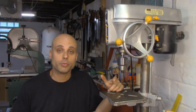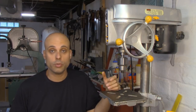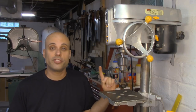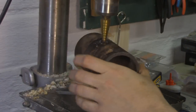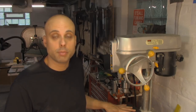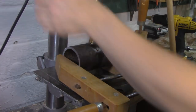During my last video where I introduced the drill press, one of my viewers commented that it's important to be careful around a drill press because they can be just as dangerous as a lathe. This has a powerful motor spinning at a high rate of speed, so if you have loose clothes or long flowing hair, you can be pulled into the machine. A drill press also has the possibility of spinning whatever piece of work you're working on, especially if the drill bit bites in and grabs it. If you take that same piece of work and tie it down to your drill press table in some secure way, then if the drill bit binds and grabs the work, it's going to stall the motor — not good for the drill press, but much less dangerous for you.